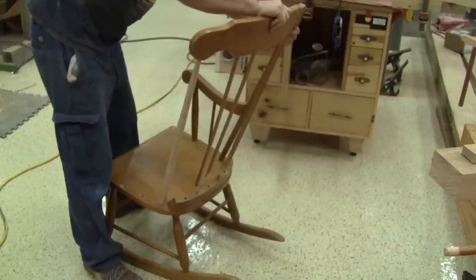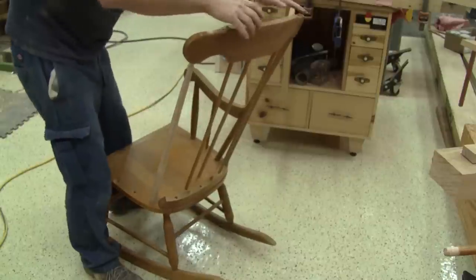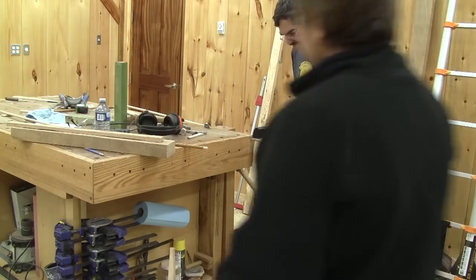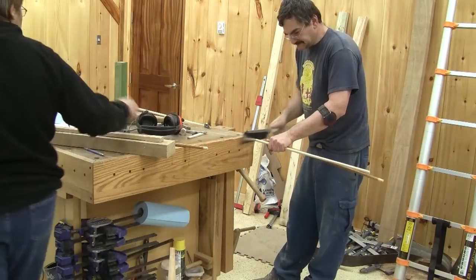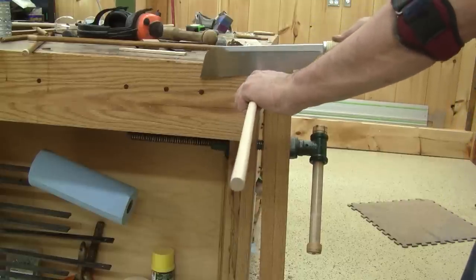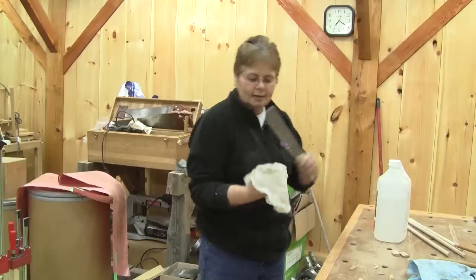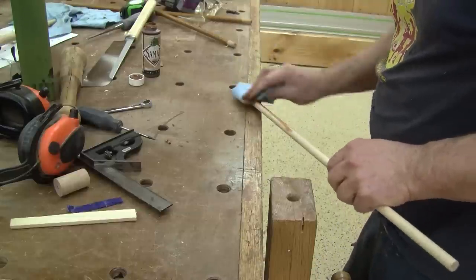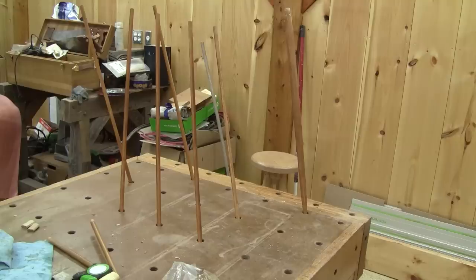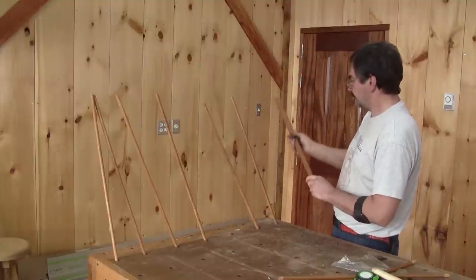Now I can try my new rung on the chair. Next I cut the dowels for the back of the chair. After all the dowels are sanded up to 220, Renée cleans all the rungs with alcohol and we can spread the stain. I leave everything like this overnight and the next morning I scrub them all with steel wool before spraying a thin coat of lacquer.